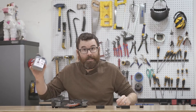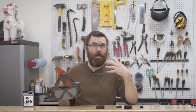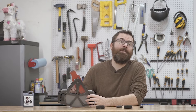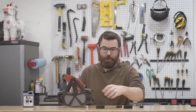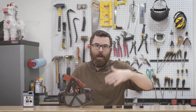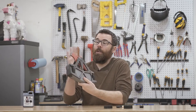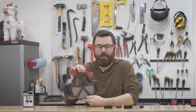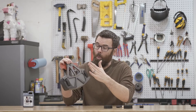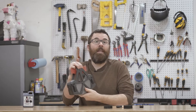Before we just go and slather some latex onto these wheels, let's first take a closer look at traction and what kind of affects it. I'm not going to do too much of a deep dive into this, but we already know that weight distribution, the coefficient of friction of the tires — which is the thing that we're changing — and also how much downforce all play a factor in how much traction you're actually getting. So let's take Psychotic Brake version two, have a little test jig over there, and see what kind of pushing power this has with the standard wheels, with a little bit of extra weight to simulate magnetic downforce, and also with the latex on the wheels.